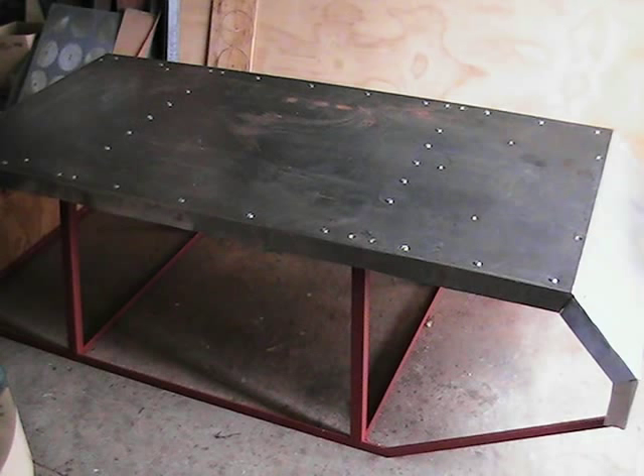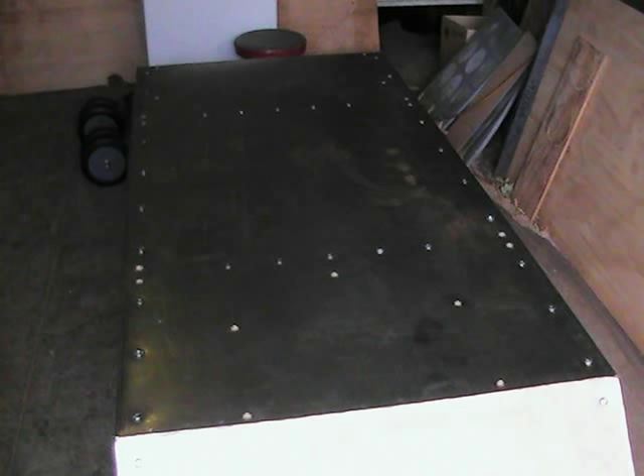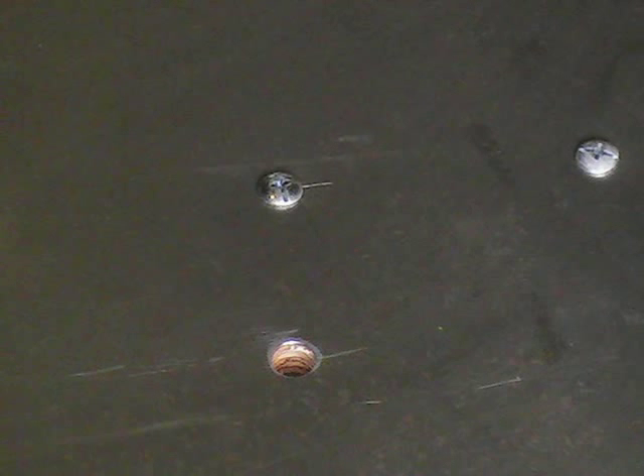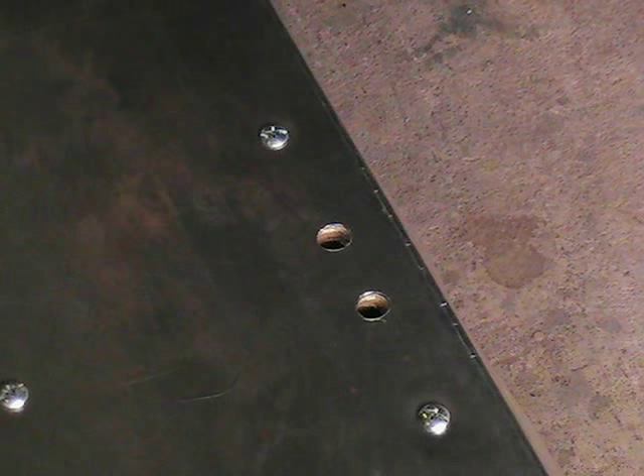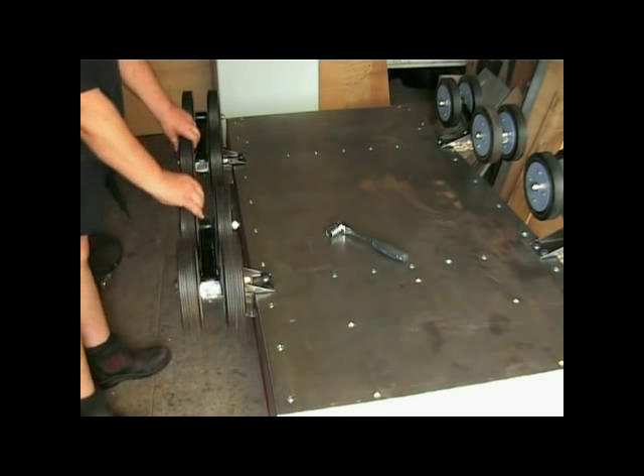To secure the sheet steel cladding in place, I first removed the screws that held the plywood panels in place and re-bored the holes to a quarter inch to take a round head gutter bolt. Once the cladding sheet has been cut and folded to suit the hull, align and clamp both the sheet and the plywood panels firmly together, then drill from the inside of the hull through the sheet steel cladding. With the cladding now firmly bolted in place, you are set to drill out the half inch holes for the transmission and suspension brackets, so that you can proceed with bolting the suspension bogies firmly to the hull.